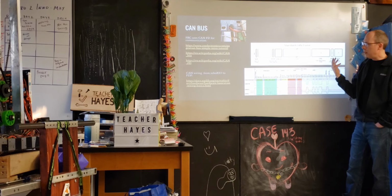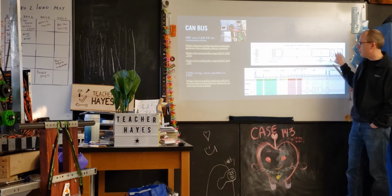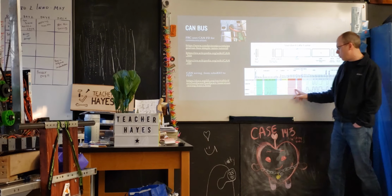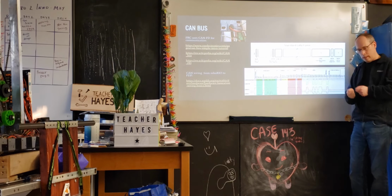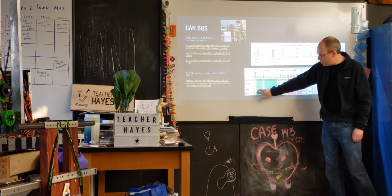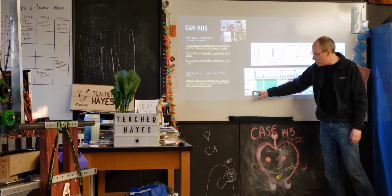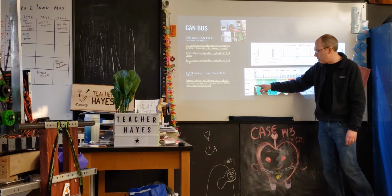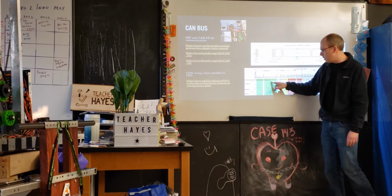What that looks like in real life, this is sort of the frame itself, what it looks like in real life are these waveforms. So if you could take an oscilloscope and look at what voltages are on the two different CAN wires, you would see this. You would see there's two wires, you look at the difference, and you would see there's 0, 0, 0, there's a one.